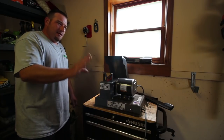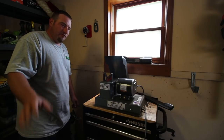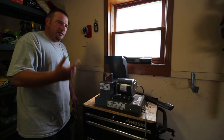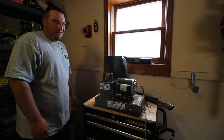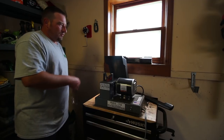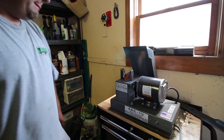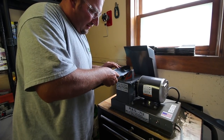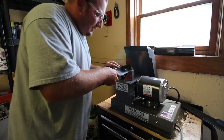You put a fresh set of balanced blades on your mower and there's no vibration whatsoever. When you start getting that vibration real good, you've hit something or your blades are going out of balance. So we're going to sharpen these blades real quick. You just lay it on here, you've got your edge right here, and it'll go automatically.